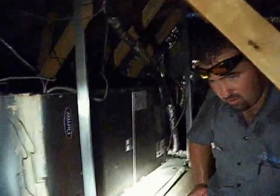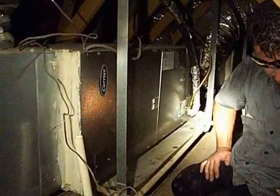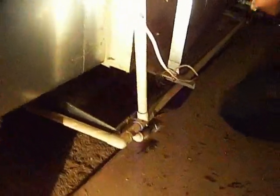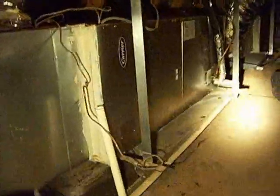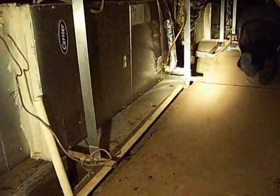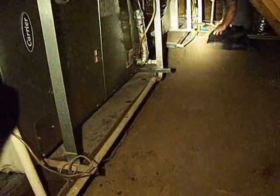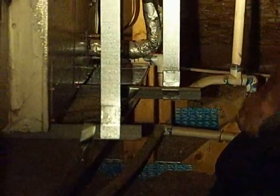Let's step back for a second — usually we'll cut the 90 coming out of the air handler and put a tee there with a cap and blast it, flush the whole trap and everything. But because of the severe pressure that comes out when you crank open a three-quarter ball valve with 80 psi water and nitrogen — or water and air — it will instantly pressurize the whole drain system. Unfortunately it blows the dirt back into the drain, but it usually doesn't plug back up real quick. We would have brought fittings but we're not in our work truck. It's a custom P-trap — look at it, Chaz Roberts — let me see if I can zoom in on it.